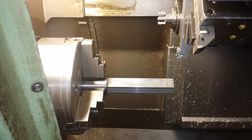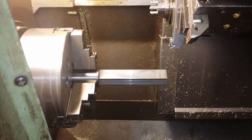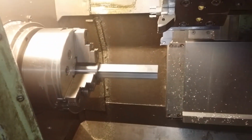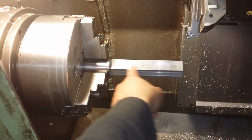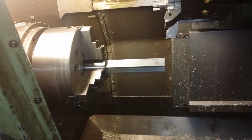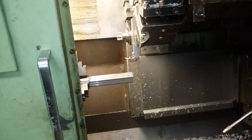And so what I ended up doing, after I pull a piece out, I will dry it out from coolant right away before I put it in the bin with the other finished ones. And what happens, actually only this part gets wet from the coolant. Anything from this forward is dry, so it should be fine.